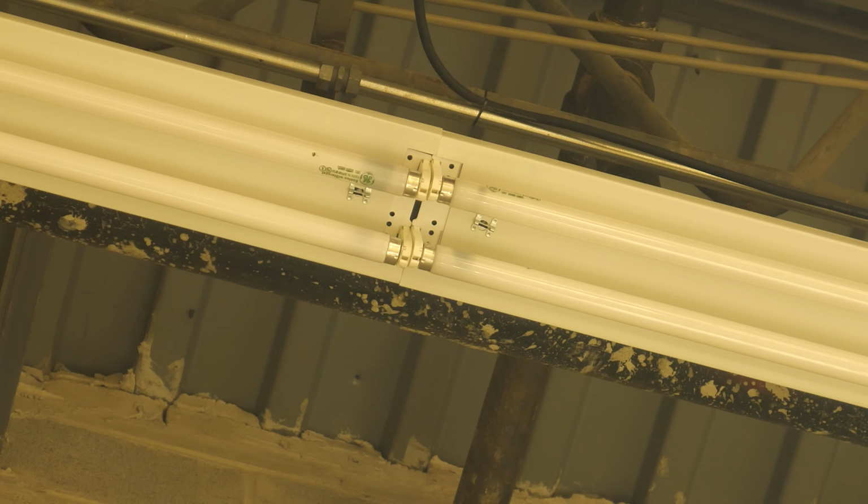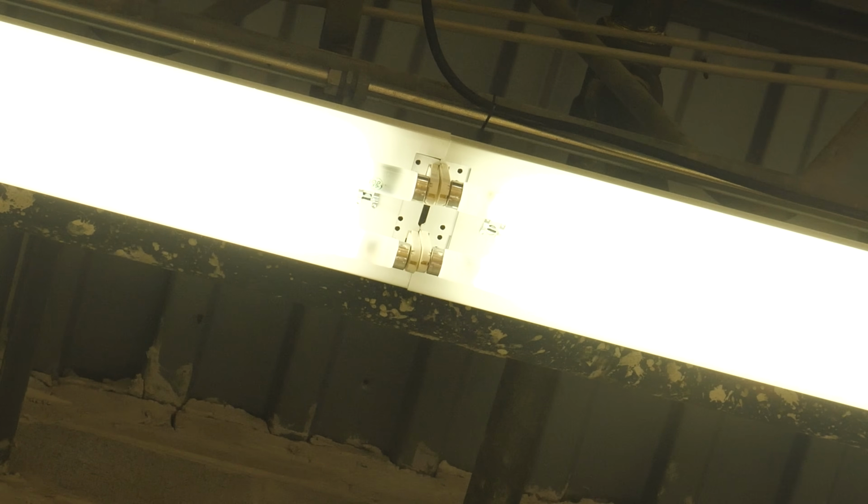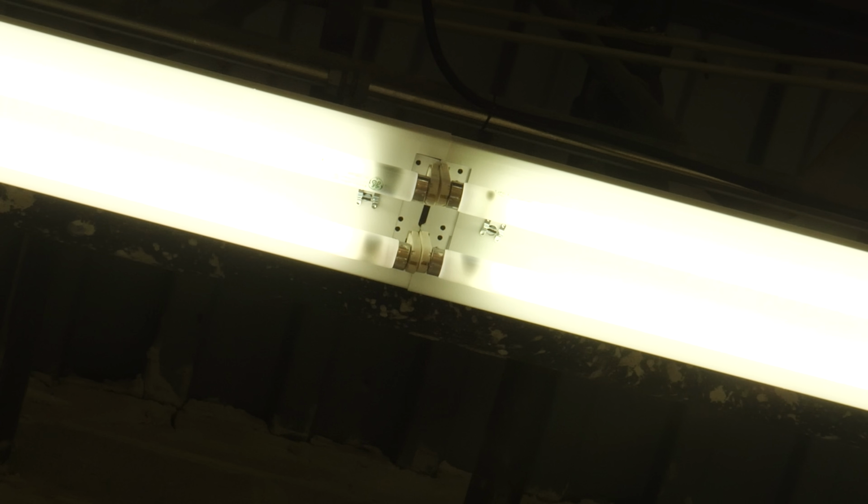The dark spots are the material which used to be the electrodes, but as it sputters off, it becomes deposited on the glass. That reduces light output slightly, but the bigger problem is that as they wear away, the electrodes lose their ability to emit electrons. That makes it more difficult for the ballast and starter to initiate the arc discharge across the tube, and eventually they will wear to the point that the tube is no longer able to start and the lamp has failed.